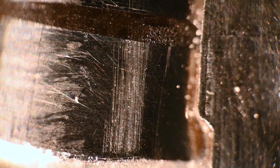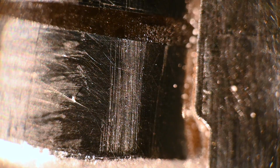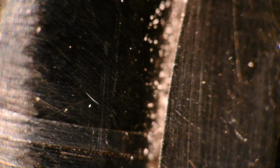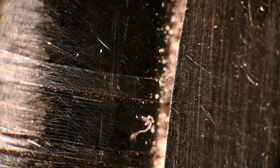But the other part that bothers me is these scratches that are going perpendicular to the path of tape travel, and not even really perpendicular, some odd angle, 5 or 10 degrees. What I think this is, I think this was post-lapping tool marks from when they bent the guides back. I think this is a scratch that happened when the guides were bent back with the needle nose pliers or whatever, and the pliers were drawn back or removed.